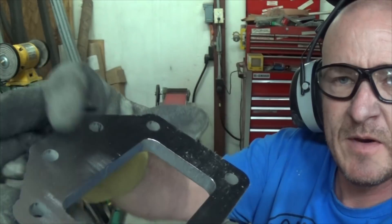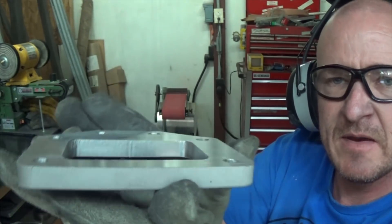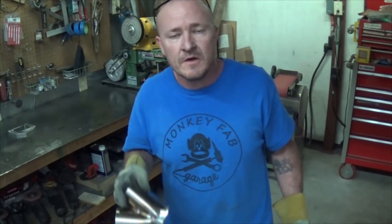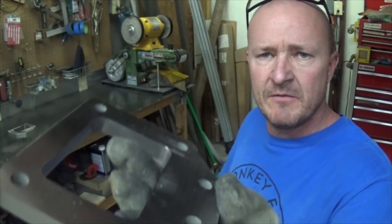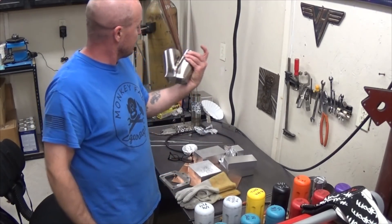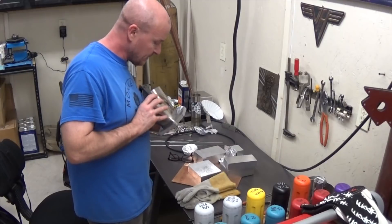There is a little bit of a low spot right there, but I'd say it's probably within a thou of being perfectly flat. So we'll take another look after we're done welding. We've got the merge ready to weld onto the flange — same flange — it's got that little bit of a low spot right in the middle. We're going to go ahead and slap this together, weld it on, and then do the Dykem test.